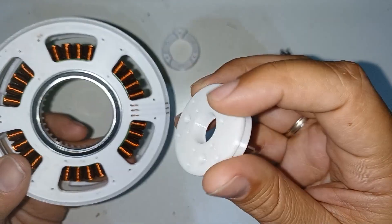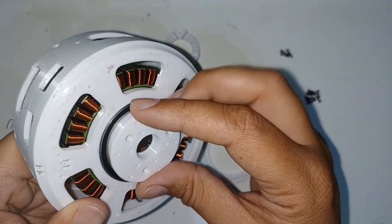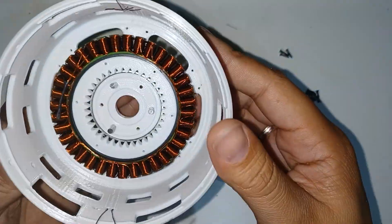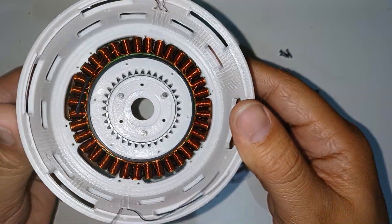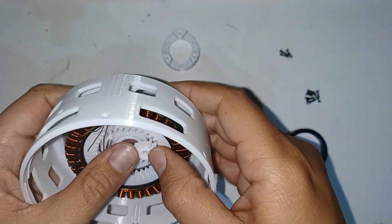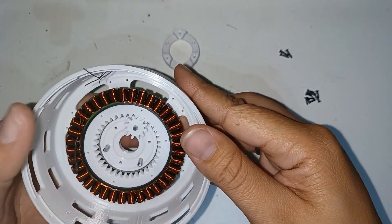The output shaft has three steel pins for the planetary gears. The planetary gear makes a 4:1 reduction in order to generate more torque, necessary to be able to move the weight of the entire quadruped robot. Place the three planetary gears and check that everything moves correctly.